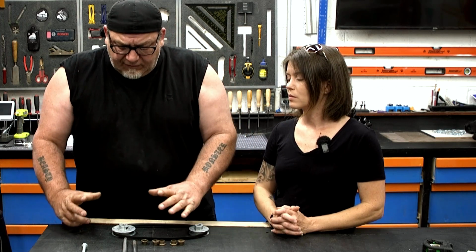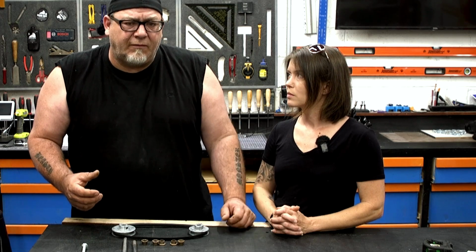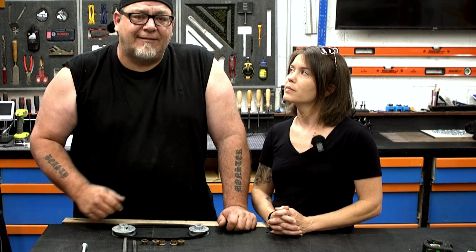Now we're putting 8-inch discs on top of this, and we need about 1 inch on either side of it just for a little bit of wiggle room. So now we know how deep it needs to be. So it's a 21.5 by 10-inch box.